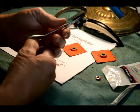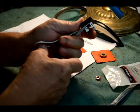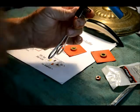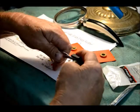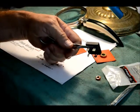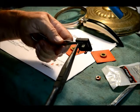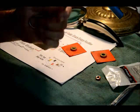The next thing I want to do is bend these prongs where they'll face the outside of our assembly when we get finished. That way the wires will be routed easier. This is a little delicate — I don't want to mess up the rectifier, so I'm going to clamp as close as I can before I try to bend them over. But they're not too tough; it shouldn't be that big of a deal.